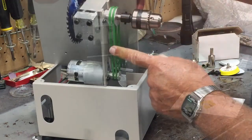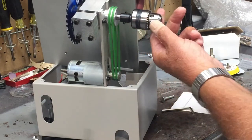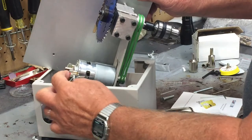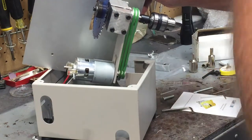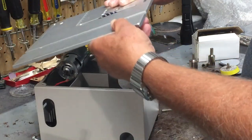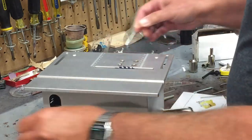Inside, there are two rubber band-like belts that turn the blade and the drill head — pretty simple. I've had issues with similar equipment where the clips that connect the motor vibrate and come loose, so if it ever stops running, that's the first thing to check. It's right back in there, so that's easy to access.